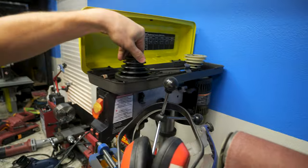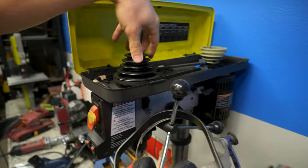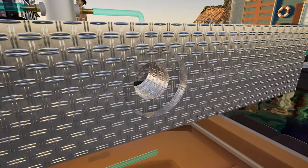Well, y'all know I'm cheap, so I'm running crappy tools around here, but we made it through that. I've got this on the lowest pulley setting, lowest speed, highest torque. The last operation we've got to do on the CNC router is drill out the O2 sensor hole, then I'm going to tap it, and then that should be it for the router.